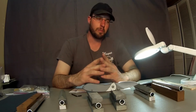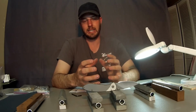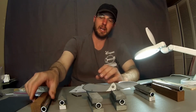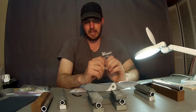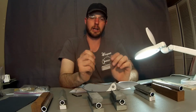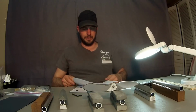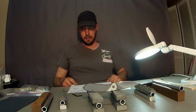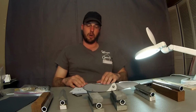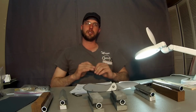Water stones are great. Water stones don't last as long, and they require a little bit more maintenance because the aggregate that holds them together is actually designed to stick together less than these oil stones. That's kind of the difference between an oil stone and a water stone: the aggregate is designed to break apart more on a water stone, so you get that fresh sharp edge of the abrasive cutting each time. But you also have to flatten your stones back out, and they're a little expensive to get into too. $30 to $80 per stone, and you can go from 6 to 8 stones. You can go all the way to a 10,000 grit stone. So water stones are really nice if you really want to do some polishing. Maybe you've got some really fancy show pieces, show knives, swords, things like that.